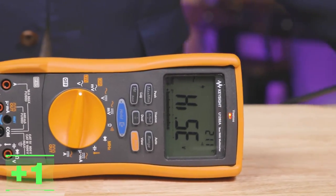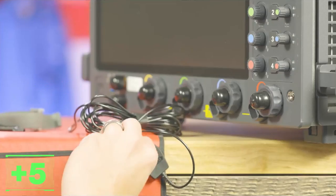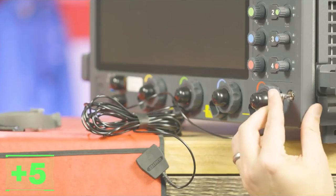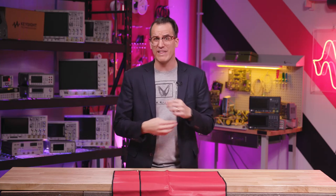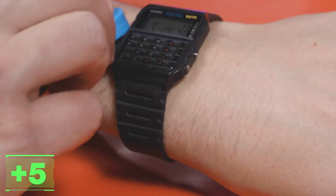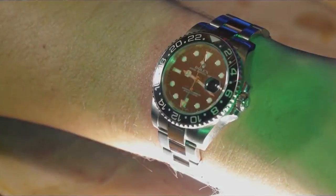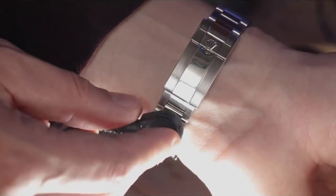And finally, a voltage detection tool that tells you if there's a no-touchy situation — my DMM actually has one built in, shameless plug. You should also protect your devices. Grounded ESD mats and a wrist or ankle strap are super important. You can actually damage your devices without feeling it; it doesn't have to arc from your finger. Don't get lazy with any of these.